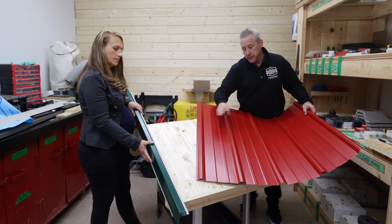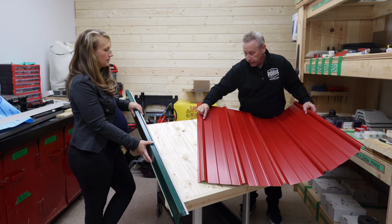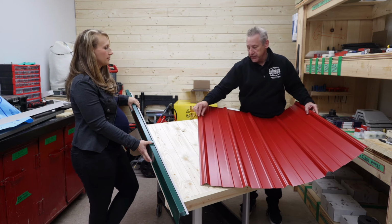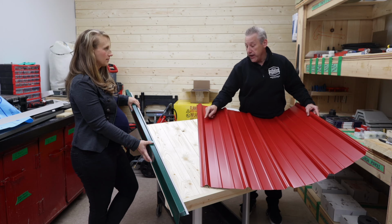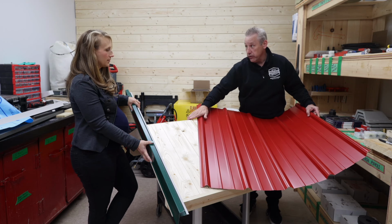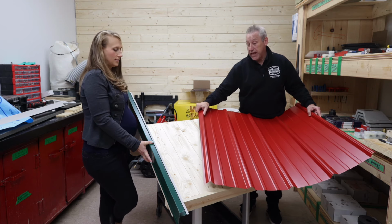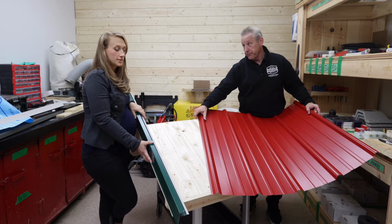And the reason is that when these panels overlap, they're designed to create an anti-siphon, which means they don't sit flush like a Lego. When they come in the packaging, it looks like it'll do just that. But when you get to this one spot, it will have a little bit of a gap in between those two, and it's supposed to. That air gap helps pull water out of the area. So if snow were to back up, it helps pull it out and not get over and in there. So it's the best lap you can find in the industry. So with the tail, it's supposed to be underneath if you can. It should be. Nice, that's a good point.